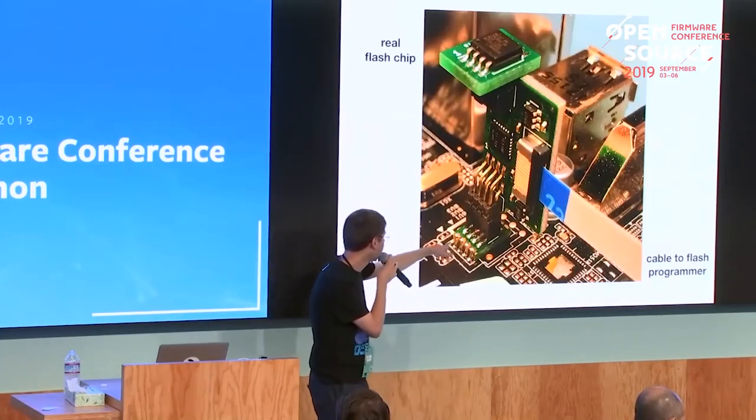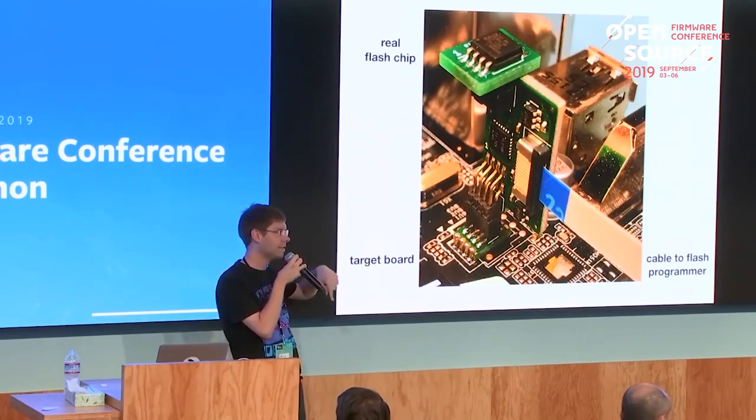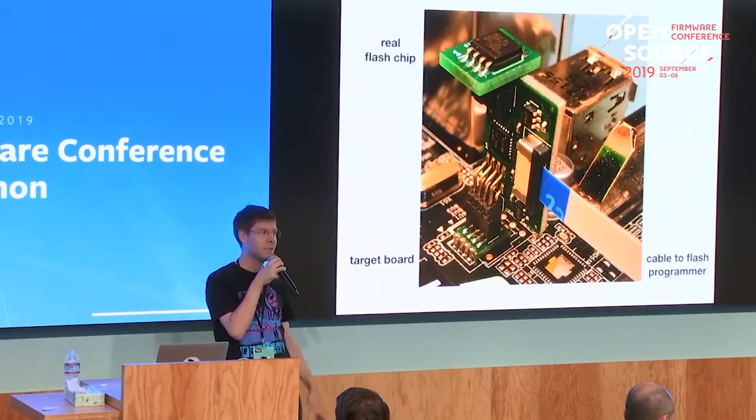Hi, Felix. Just a quick question on the pricing for the BOM. How much would it cost to build yourself? Parts cost. Part costs are, I think, between $10 and $15 for the whole set. But yeah, the PCBs, it's not that well to see here. Basically, you need a special process where there's copper at the edges of the board. I have a few samples with me, so you can have a look at it later. That has some initial setup cost, basically once for the whole set of boards. And the board itself is also a four layer board, so it gets cheap when you order like 100 or 1,000 of it, but just for 10, it's a bit more expensive.